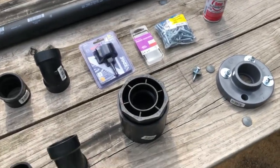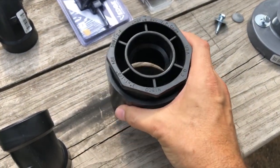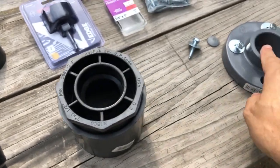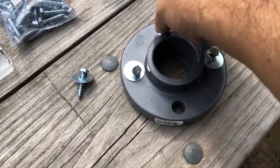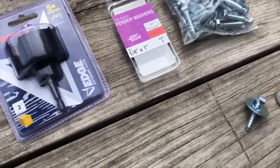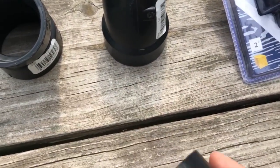I'm going to show you the pieces it takes to do this and two potential endpoints into the toilet itself — I bought two just to see which fits better. Here's the parts list. The most obvious thing we have to do is plug the three-inch sewer pipe and convert it down to essentially one and a half inches. This fitting is what will go through the floor, secured by a device that holds that one-and-a-half-inch pipe to the floor using lag screws and washers — you can see the part numbers on the packages. I'm going to drill a two-inch hole using this hole saw.